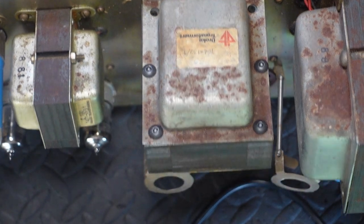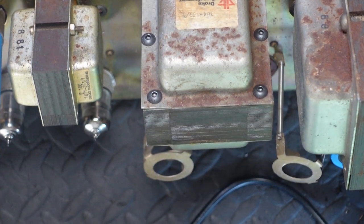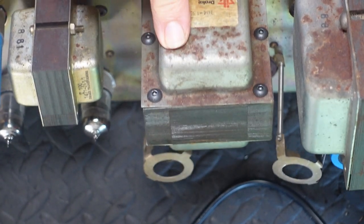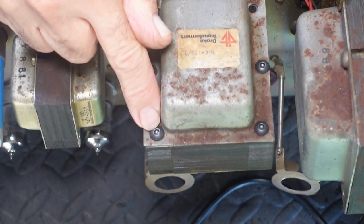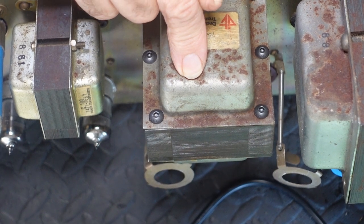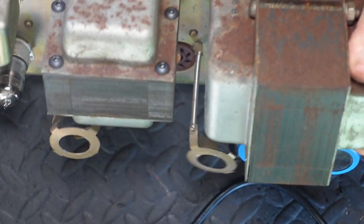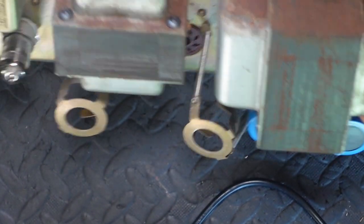So why am I such a stickler about transformer mounting and stuff like that? I mean, it doesn't matter if it's a bit loose. Well, it does. Because the heart and soul of your amplifier is these two lumps of iron. The output transformer, probably the most critical of all in my opinion, because your sound literally passes through this one. Your power transformer, sure, it has an impact on the sound, but not as directly as that.